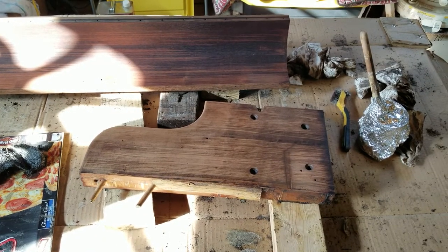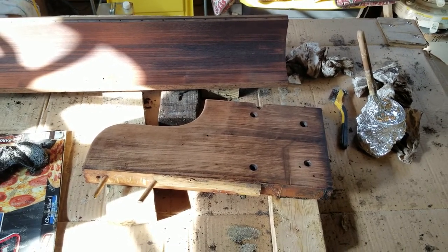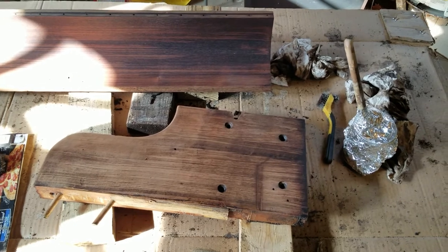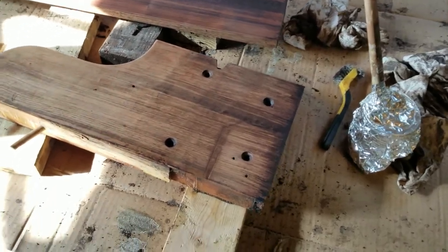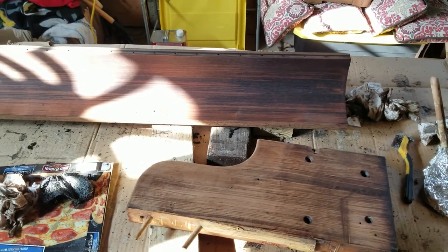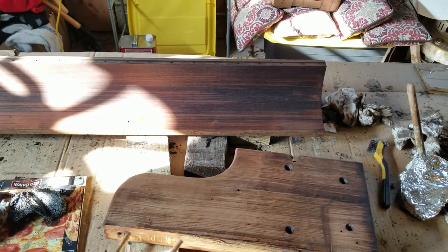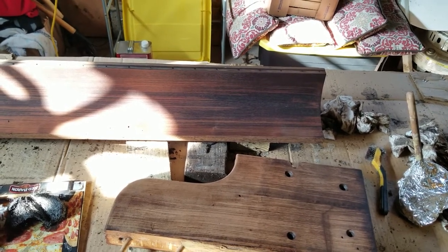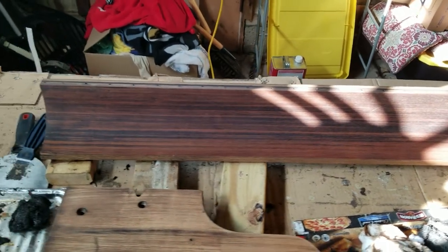Here are those pieces I was stripping — these probably have two or three coats of stripper applied and scraped off using mostly steel wool by hand. I'd say these are pretty close; I'm going to go maybe one more coat just to get some of the black on the right edge of the arm piece. This piece of the fallboard behind me looks like it's pretty much completely stripped. The fallboard pieces are much darker than the rest of the piano pieces even though they're stripped — they just have a different veneer — but those are down to wood.